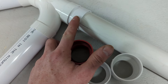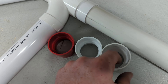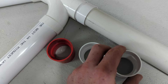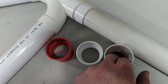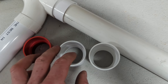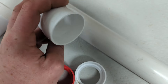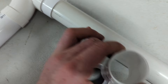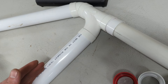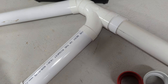Then you insert your hose stop fitting, which is simply a reducer coupling — different designs for each brand: Chameleon, Hide-A-Hose, and Retroflex — but all it does is provide a place where the hose end can't get past it. Because a hose will stretch a little with age, if you have a 40-foot hose and about 41 feet of piping, eventually the hose will stretch enough to hit this fitting. Without it, the hose would either go past a T-junction and block off a different part of the system, or get jammed in an elbow — neither of which is good.